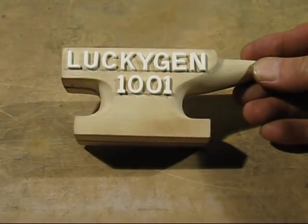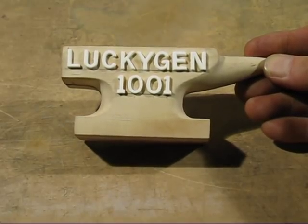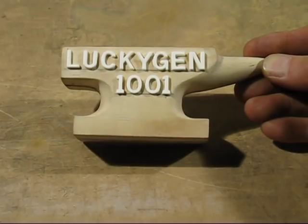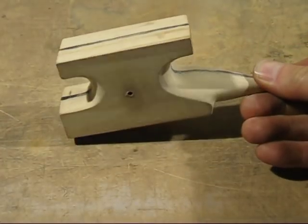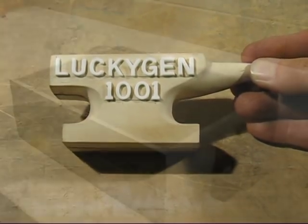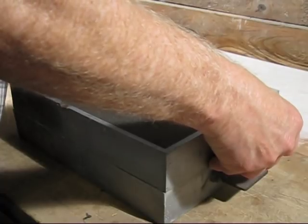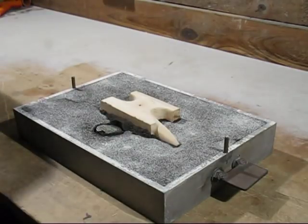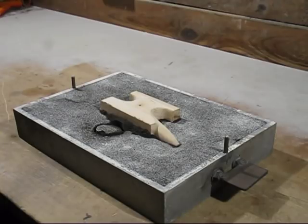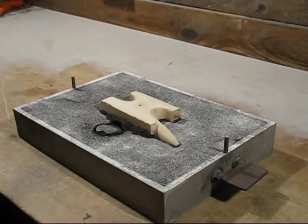This is the pattern I am going to use today to test the sewing machine scrap. I carved out a rough likeness of an anvil and glued on my YouTube name with letters. Here is a view of the back. This is the anvil mould — we will see how it separates. The separation was poor and a bit of grinding is needed. I did not get the pattern square, so we will give it another go.